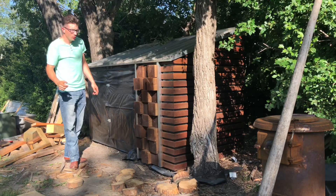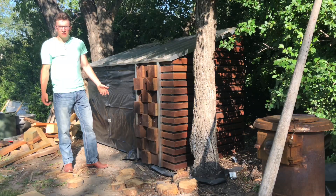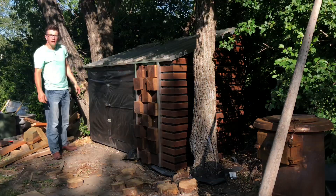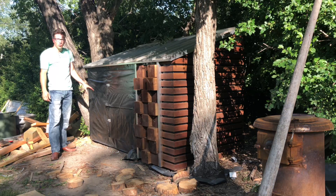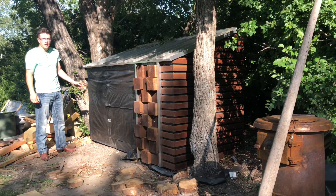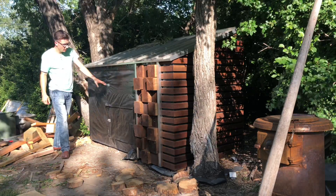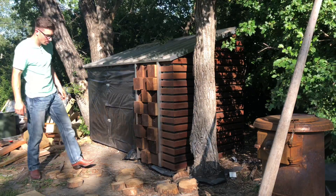So that was episode two of the firewood bin video. I'm going to have to do an episode three just because it's taking too long. Like I said before, all these wood cutoffs on the ground are going to go along here. And I think I changed my mind about what I'm going to do over here - I think I have access to some old nine-inch cedar siding, so I think I'll flip that around to the rough sawn side, stain it the same teak color, and put that up along here and maybe around this corner. Then just do these wood cutoffs right here. I think that might look a little bit better.